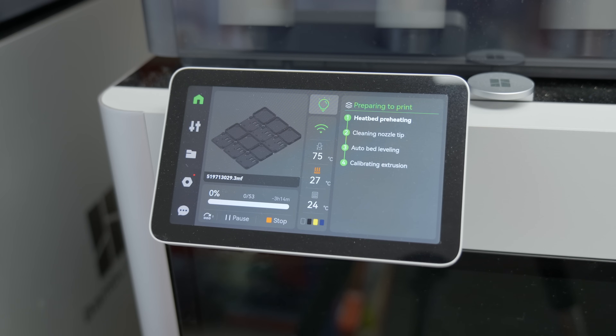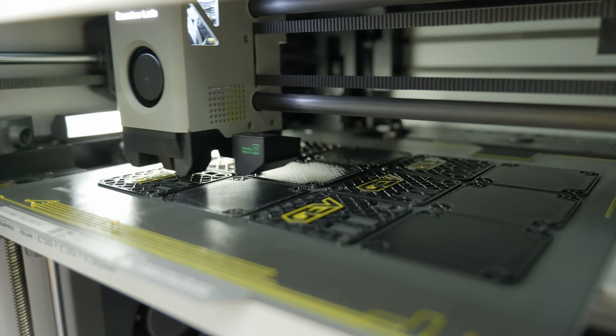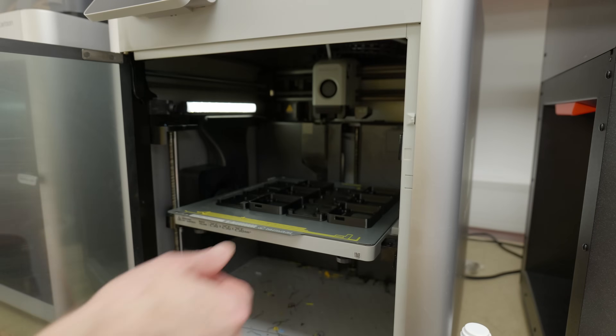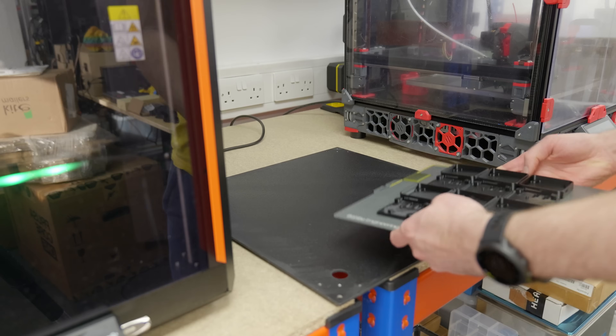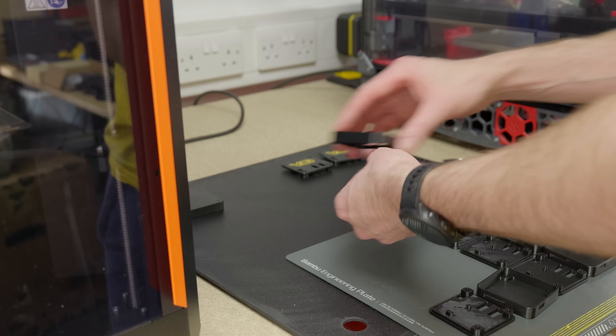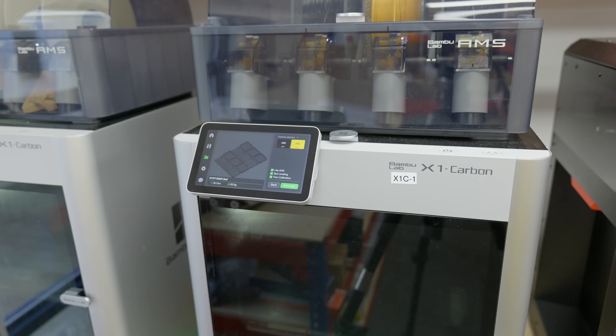With the final design completed, I then sent it to the printer at a full batch, filling the plate as much as possible, so I can validate that the whole thing is going to work as soon as we start batch printing. Because any little things that pop out when you print six or eight at once can be potentially a big problem if you print 200. So once we got through that process and made any little tweaks necessary, I was happy that everything could print in large quantity and just kept sending them to the printer again and again until we had all the ones we need.